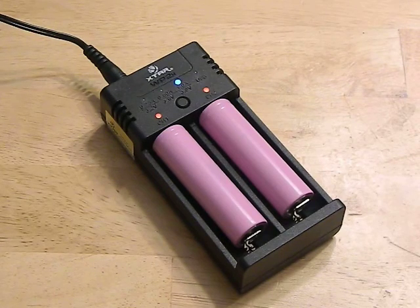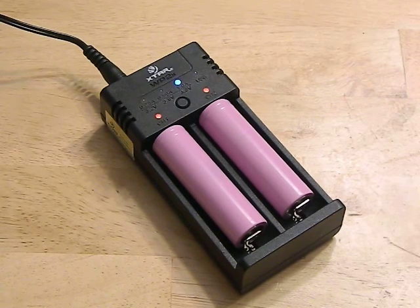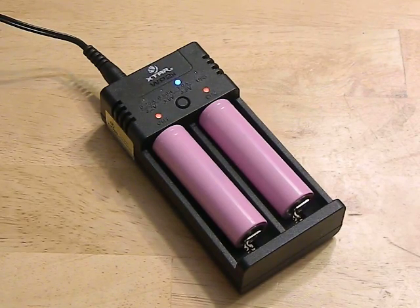I ended up buying this after the fact for my handful of Samsung 18650s that charge up to 4.35V — not even realizing they were 4.35V cells when I bought them. There are better chargers out there, and I only paid about $14–15 for this. But it is one of the only chargers that does 4.35V batteries, so you're kind of stuck. It is a bit of a necessary evil — it will let you top them off, but it obviously needs some work.